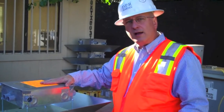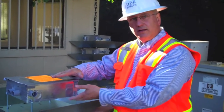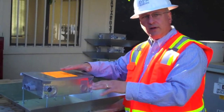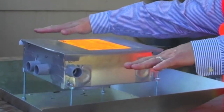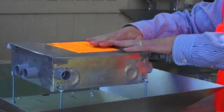What we're looking at here is one of the floor boxes that go in the concrete. The thickness of the concrete, if you just put the box in, would kind of leave a hole in the concrete and leave it unstable. So they build these boxes for the concrete to flow under and around, and it creates a smooth surface and anchors everything in nice and deep and won't go anywhere.